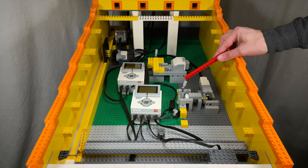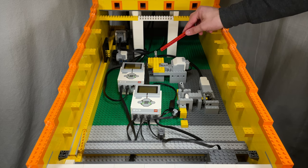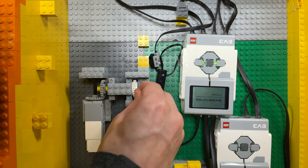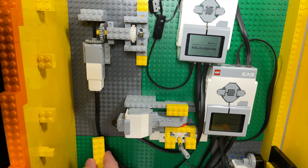Here's what powers the board. This front motor powers the chain assembly, and this back motor powers the wave of yellow beams. I also added clutch gears to the motors, just in case anything seizes up for one reason or another — they would just slip instead of exploding the whole gearbox and throwing gears everywhere.